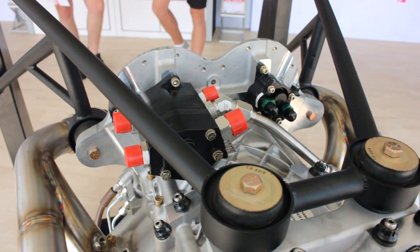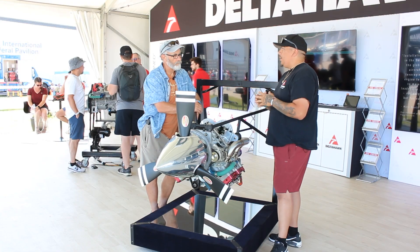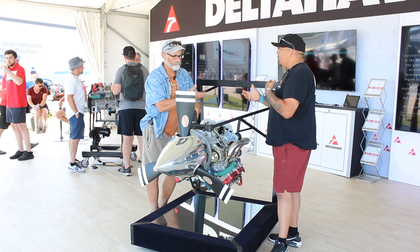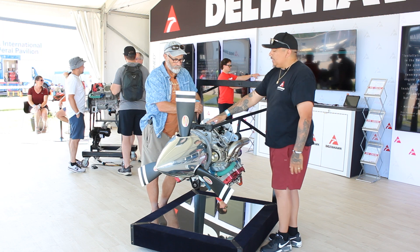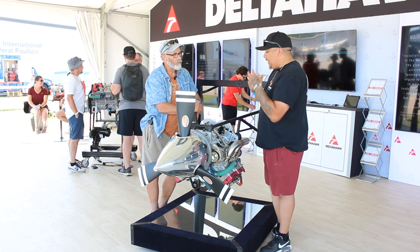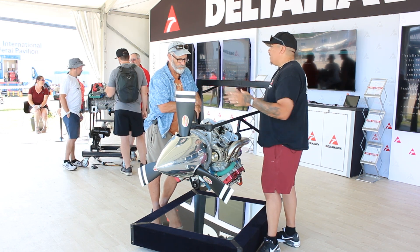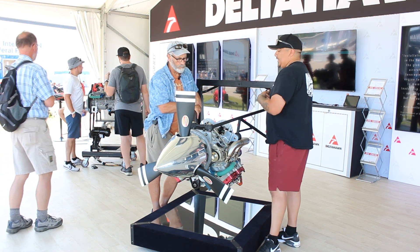That's what you see right here. In the RVs we'll probably be running it in this configuration, and typically that's what we have been doing. The nice thing with ours is that if we ever get into an installation where it just doesn't work, we can flip it in any orientation. That dry sump oil system is really nice because it's constantly feeding oil but also taking out oil — it's constant all the time. What's going in is leaving just enough to keep everything well-lubricated, but it's also returning all that extra oil back to the tank. There's a tank that's sucking from multiple locations.